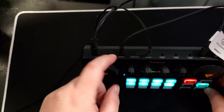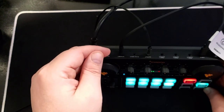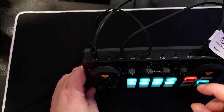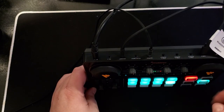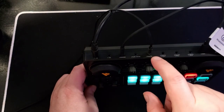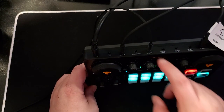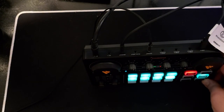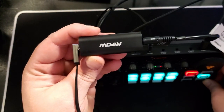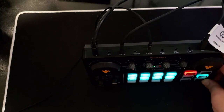You've got a second spot for another mic. This is a headset jack for monitoring — you hear your desktop through it as well, you hear your Discord chat, game volume, and game chat; it'll all come through here. The music input — I don't think you'll ever use it if you're going to use this for Twitch streaming. This output is what you will hook up to your streaming PC — I have a regular stereo 3.5mm jack, but I also had to use one of these ground loop isolators.